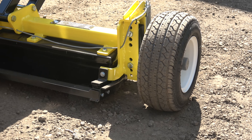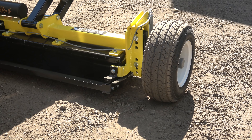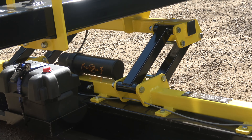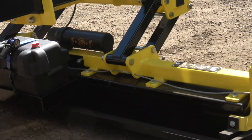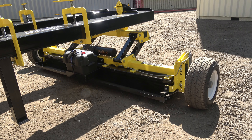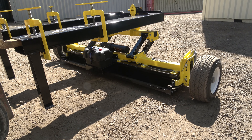When you set your sweeping height — this one's set at about three inches — it'll keep the bottom of that magnet tray at whatever height you set it at all times. You've got 11 inches of suspension travel from these double dog bone-style linkages, up and down, plus a pivot function from the big nut on top. That's our ground tracking suspension system, which keeps the magnet on the ground at all times. You can drive pretty carefree over whatever you can get your forklift over, and if you do hit the ground, it's not a big deal — there's a big stainless steel pan.